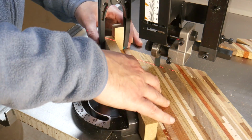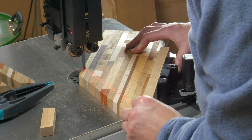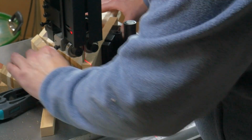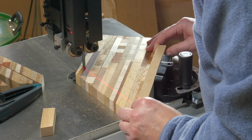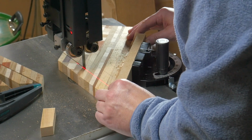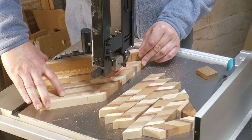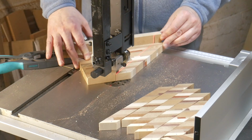The knowledgeable woodworker watching this video may wonder why I did not use a table saw with a 45-degree sled to cut the strips. It would be faster and more accurate, and with a good blade I wouldn't need to hand plane the sides. The problem is, I hate my table saw. It's too small, it's powerful alright, but not accurate at all. And it makes a rattling noise when reaching full speed that shakes my vagus nerve into cowardice.